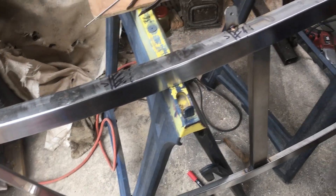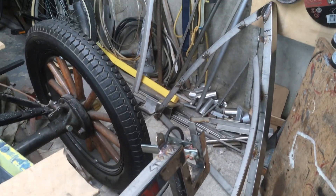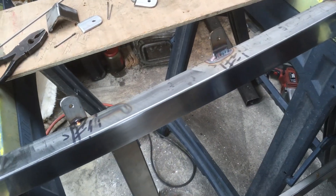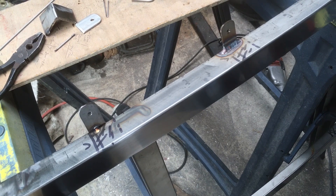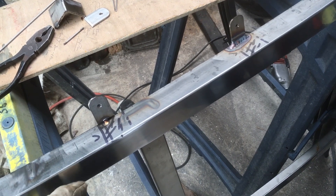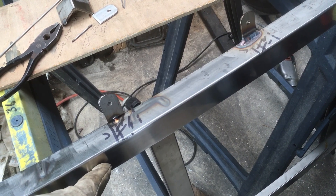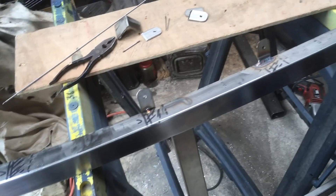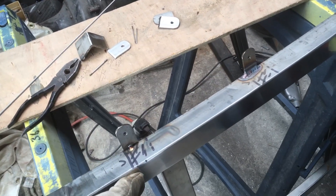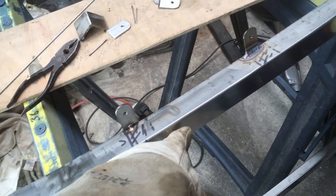The polishing is working slowly. I get to the final stage with angle grinder mop pads, then I use wet and dry — starting at 240, then 320, 400, 600 — and then it should be good with a polishing mop and compound. I found that going straight from the scotch-brite pad to polishing still leaves lines, so going through an intermediate hand-sanding stage gets rid of scratches before the final polish.